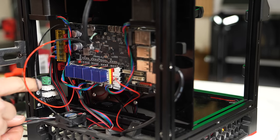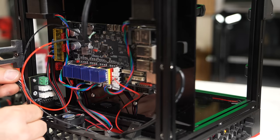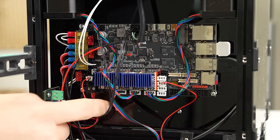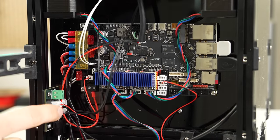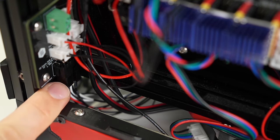Once you've got the Kirigami installed and your wires ran to the back of the machine, the breakout board mounted in the back is straightforward to install. Other than plugging in the other end of your microfit, you'll need to connect the bed heater, thermistor, a fan, and NeoPixel from your controller to this board so it can feed them through your wire harness.